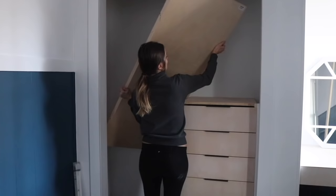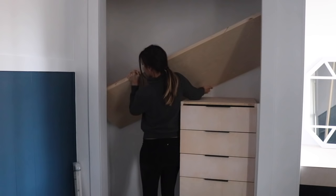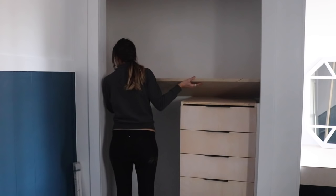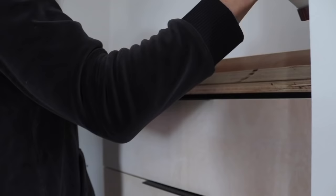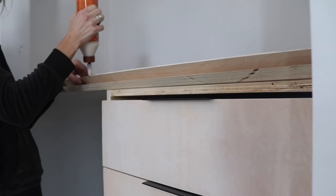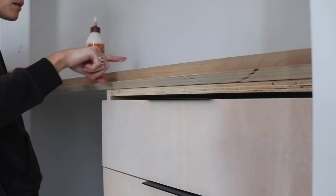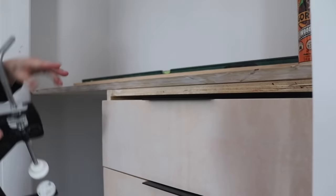On top of the drawer system, I'm using another piece of three-quarter inch thick plywood to create a shelf. This shelf was not easy to get in — it's a very tight fit. But it's going to cover up the Kreg holes on the top of the box I constructed and give some separation to the closet design as well as more storage surface. The front of that shelf I cut at a bevel, 45-degree angle, similar to what I did on the floating desk in the room. Then I cut another piece of three-quarter inch plywood to put along the front as a trim piece — and this spans the length of the closet jam so it looks very continuous and built in.